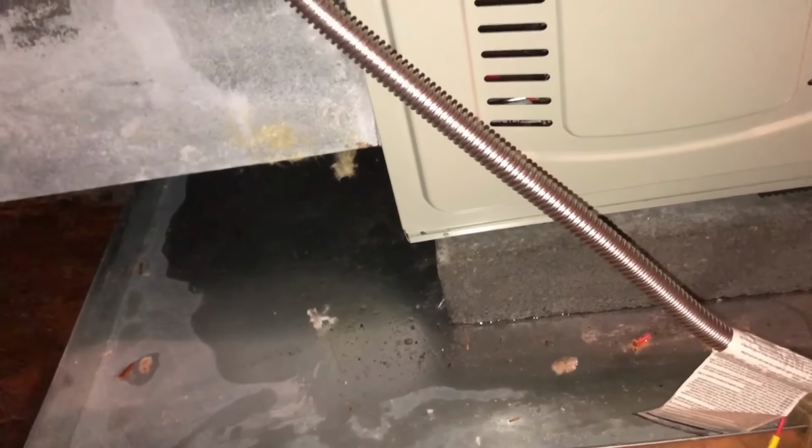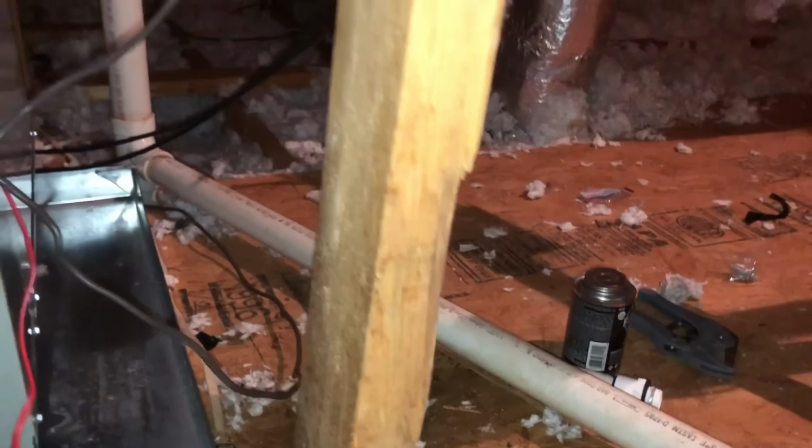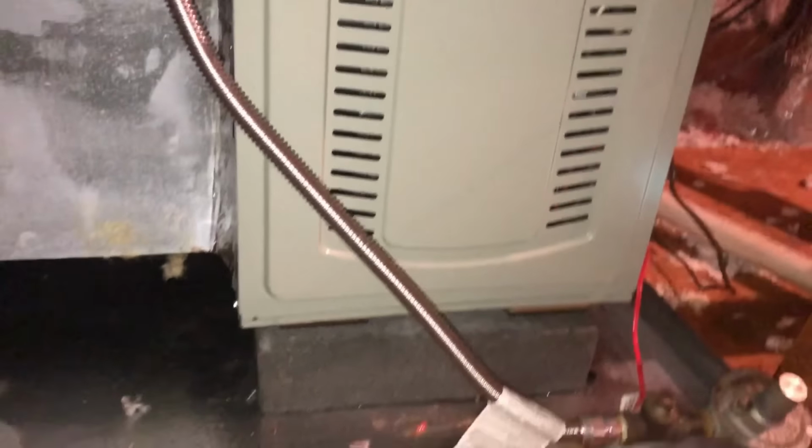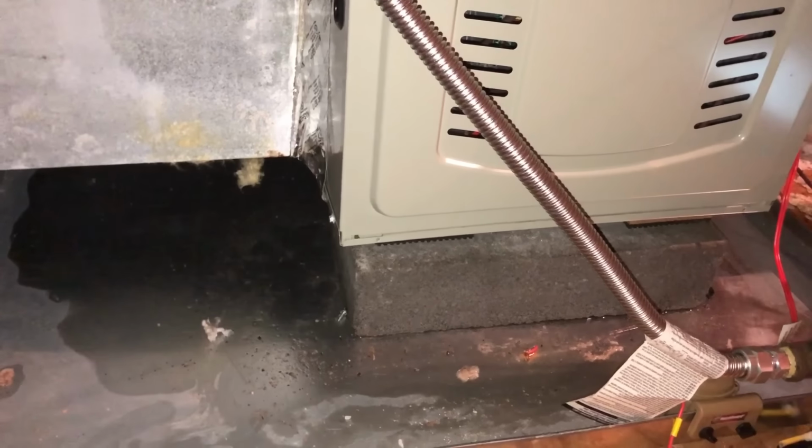So I would be okay with whatever else you did, other than overlooking the secondary pipe running uphill and possibly cocked at an angle, which can let water escape out of the bottom of the gasket. That's what looks like happened here to me.